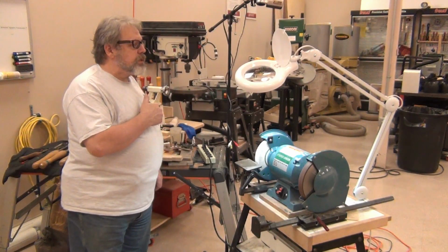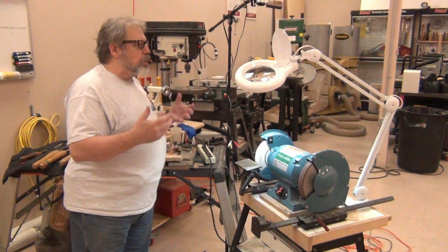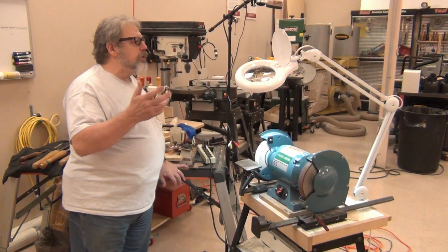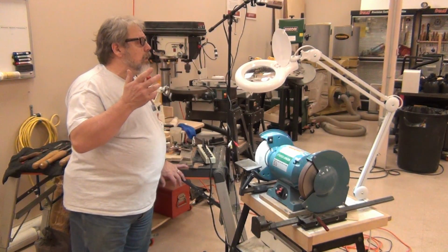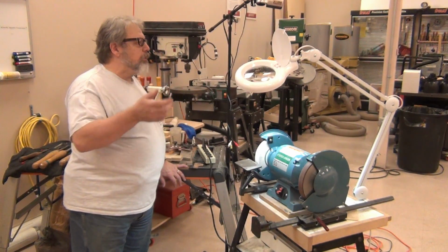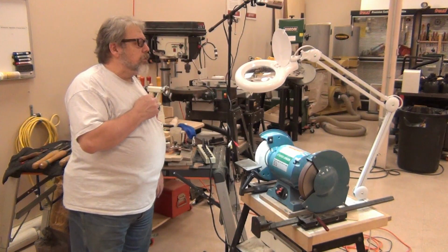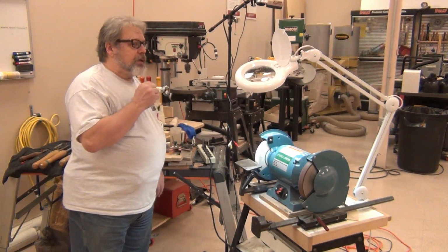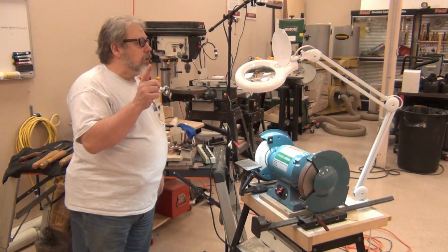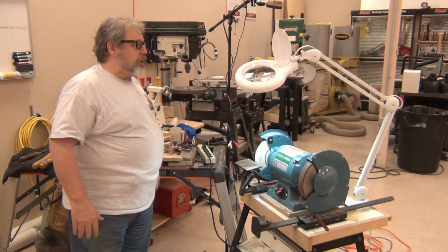On a high-speed steel tool, it's a much more elaborate tempering thing. They control it based on the metals, whether it's M2 or whatever. But it'll be between 700 something and 900 degrees to be the tempering temperature, and you're not as likely to lose your temper. But if you ever use high carbon steel tools and you turn them blue, it's gone, all right? You have to grind all that blue off and get back below that, and if it's bad enough, you can reheat treat, okay?